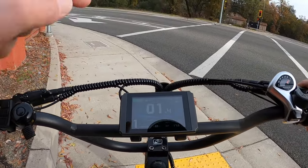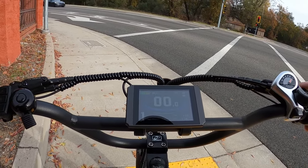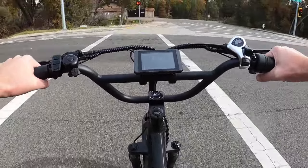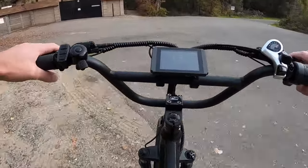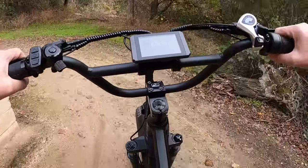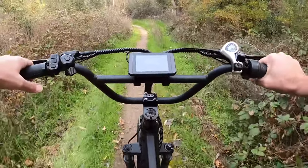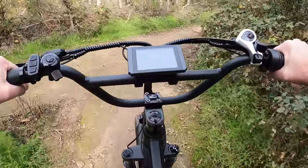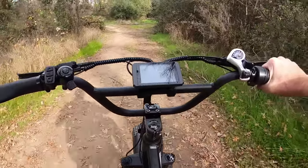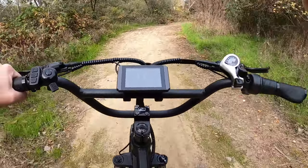I have the battery charged up, but it's not completely full — we're at 65.5 volts. I also like to leave my batteries just under full charge and away from the very low end. If you've ever used lithium, especially LiPo batteries — this is a lithium-ion battery, so it's a little different — you basically do not want to leave them fully charged or fully discharged. It's like your stomach: you don't want to be completely starving and you don't want to be really full. Battery cells for lithium like to be somewhere in the middle, ideally between 20 and 80%.